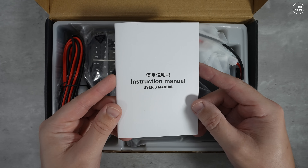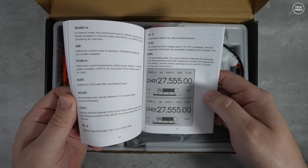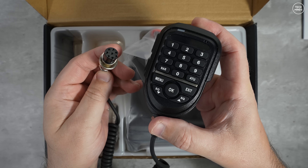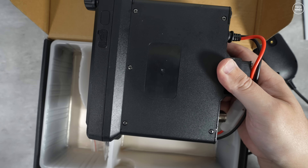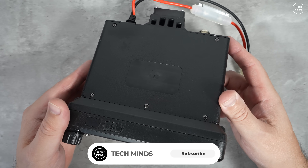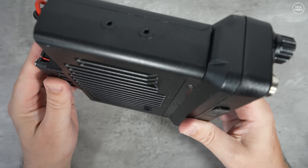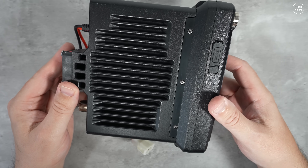We're going to take a look at this radio — the Ham Geek model 6699. This is labeled as a CB radio; you can't exactly miss the marketing on the box. What this radio has, which I've not seen before on these types of radios, is that it can apparently receive from 1 MHz to 30 MHz, all-mode, and transmit from 25 MHz to 29.999 MHz, also all-mode.